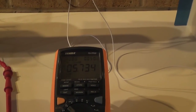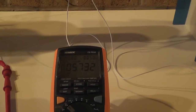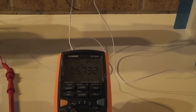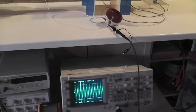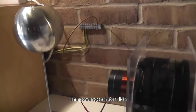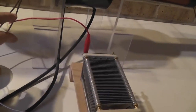Let's see what the oscilloscope says. I will set it up on the oscilloscope now and check out the performance — it will give some more details about the harmonics and what happens when we interfere with stray capacitance from our body, to see how the energy flows and how it aligns to the vibration. My setup is now as follows: in the tradition of a Tesla coil, the lower end of the Tesla coil is connected to the ground, which goes through a variable capacitor, so I can change the capacitance between the inbound side.